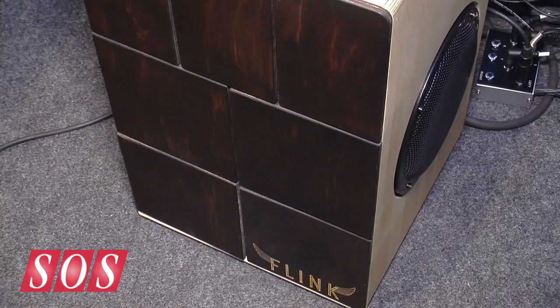So what's the pad technology you have here? Obviously getting physical isolation between the different pads is a challenge. Yes, this was really a challenge during development and research — we recognized it was a big issue because of the loudspeaker vibrations potentially triggering the pads. But I think we did it in a very good way, because the loudspeaker is really isolated from the rest of the system, and the pads are mounted with a special rubber.